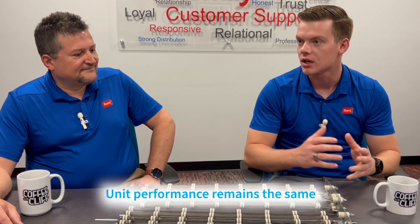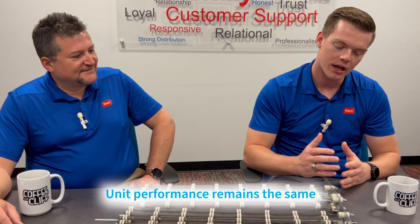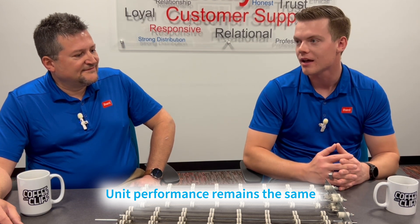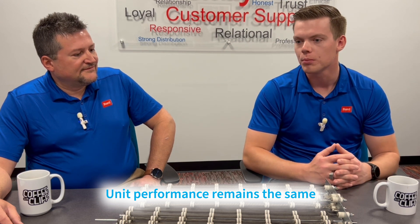The other side of that is the KW FLA — the actual KW value and the BTU output. In fact, they are the exact same part. The only difference is they use different backup limits. While we rated them to 240 volt during UL 1995, we are now rating them to 230 volt because it changes what voltage we have to run electric heat testing at. Since electric heat testing was run at 230 volts, that's what we're rating them at. You might see subtle differences between the KW FLA and the BTU output, but nothing is actually different — they're the exact same parts.